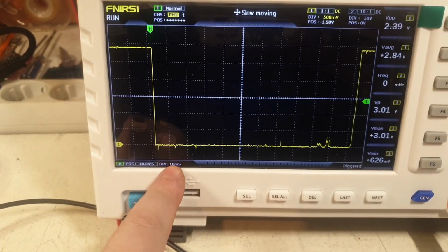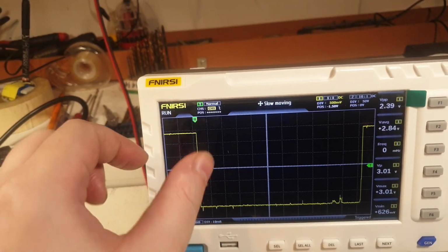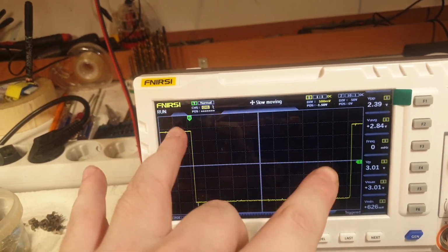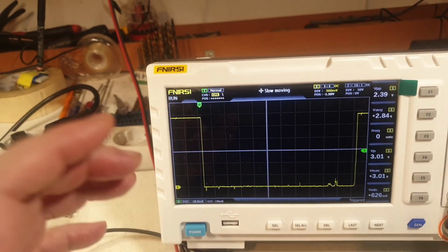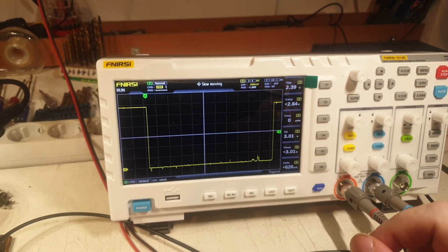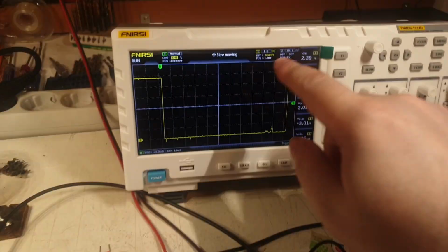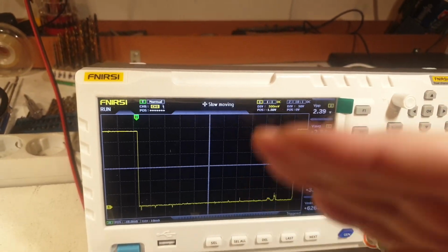If you change the timing for the horizontal here, if you change the timing too much, you have to kind of put it in equilibrium, somewhere in the middle, meaning to be on the screen. Don't ask me how to do it. You have to tweak it until you get it. And then the trick with higher voltage, like here, to read what is displaying there, and then to lower it down, and then you will catch it.